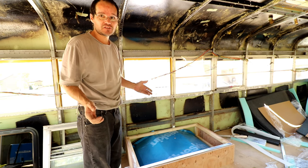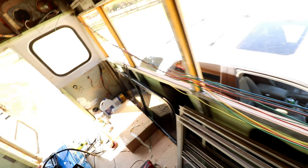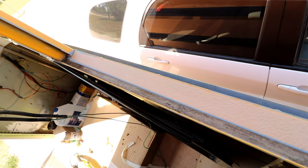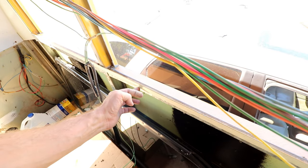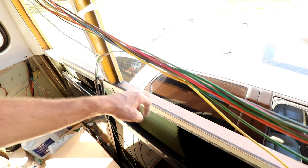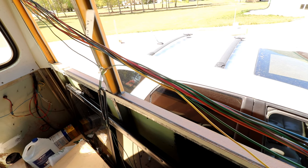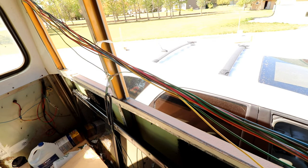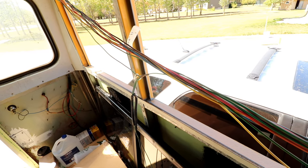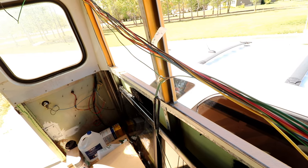I'm not sure if I'll show you the next step — it's gonna be a lot of frustration. I don't think you'd want to see me losing my temper. But anyway, the next step is to remove all this old caulking and garbage here. As you can see, this lip comes up around and then down. I have to cut this lip off. I'm either gonna use a sawzall — some people know it as a reciprocating saw — or a grinder. I'm gonna cut right across there and take that out. I got ideas already on how I'm gonna do it.